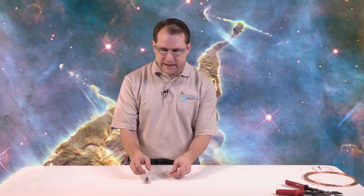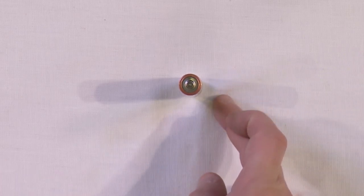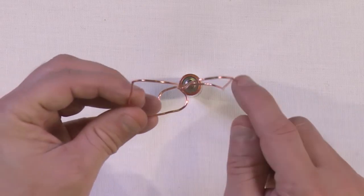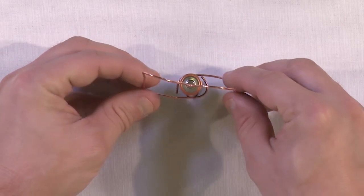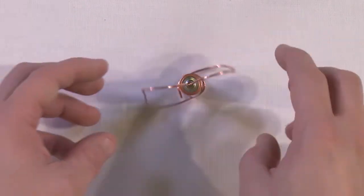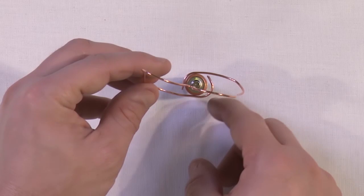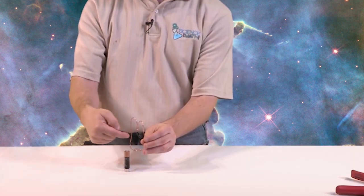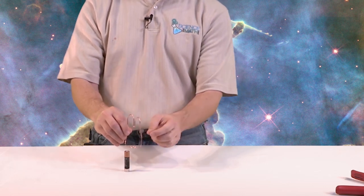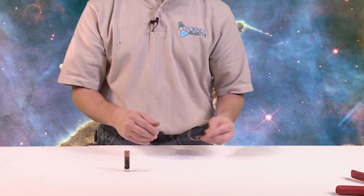Right? Now in this particular case, the direction of the magnetic field, that's all invisible by the way, you can't see the magnetic field, but it's here. The direction of the field and the direction of the current line up in such a way to cause a force to want to push this guy, which direction? In the clockwise direction. So the current is flowing down through and going in this direction. The magnetic field is down there around that magnet, and the two directions of the magnetic field and of the current tend to put a force on this side of the wire, pushing this way, and on this side of the wire, pushing this way. So what you get is a net turning effect. So the force on this wire is going that way, the force on this wire is going that way.